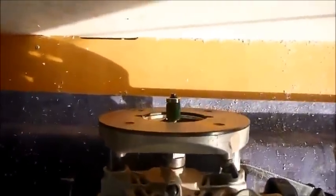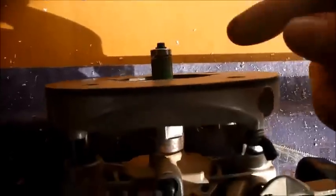Another quick update on the router. The router bit bearing at the end is exactly the same width as the cutting blade. If you put it flush against your wall unit, this is what happens — beautiful. So I'll now just go round with the router all the way round, end up with that, and it's ready for the window rubber. It should be 30mm.